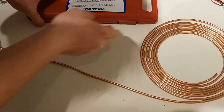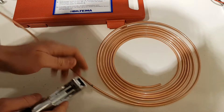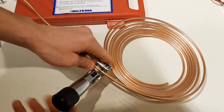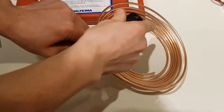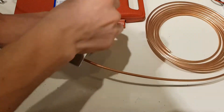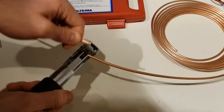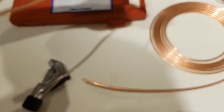Once we have the line marked, we take the cutting tool from the kit. The cutting process is pretty simple — you untighten the tool, put the pipe inside the rollers aligned with the mark, then turn it around and around. When it gets easier to turn you tighten it again and continue until the pipe is totally cut through. You can see it loosen up and we get a perfect clean cut right there.